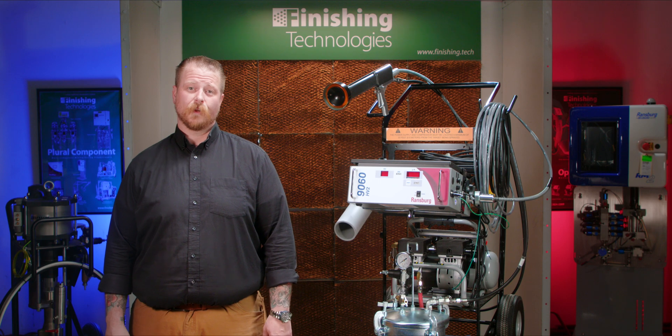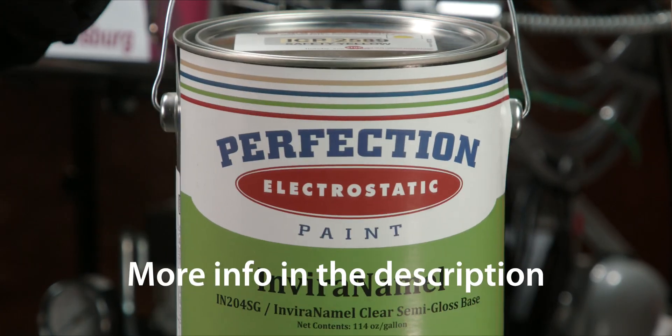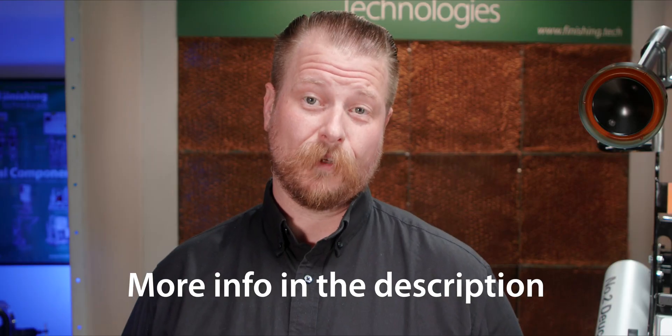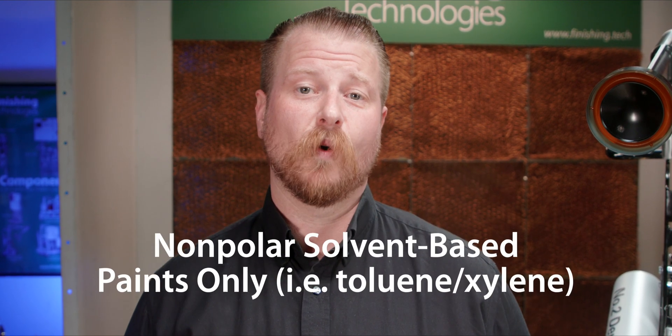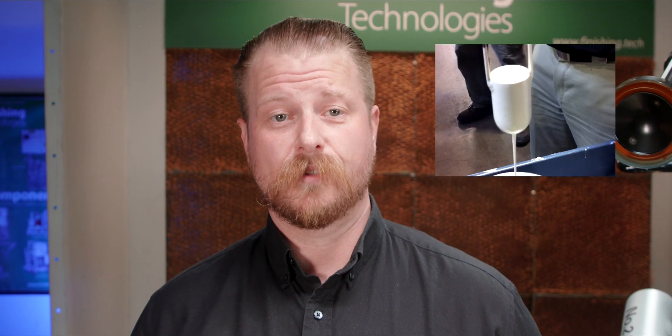It is very important to note that this system requires a special electrostatic paint. These are available from most paint stores that specialize in industrial coatings. There is a line of paint that is manufactured for use with this equipment, which we highly recommend for hassle-free application. You may also use your own paint, though it must be ready to accept this system, which means it may need to be modified with special thinners so that it has a conductivity of 0.1 to 1 megaohm, with a viscosity of 20 to 60 seconds in a number 2 Zahn cup. Ask us for more details.